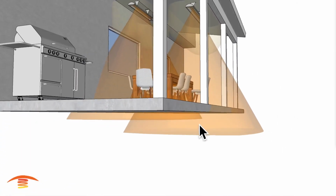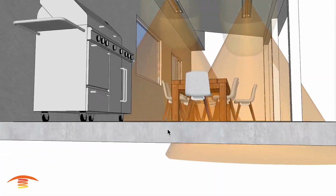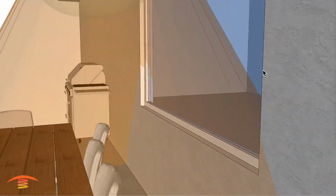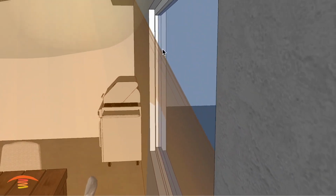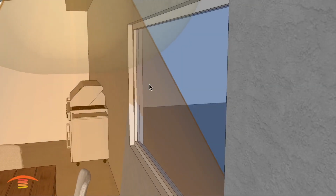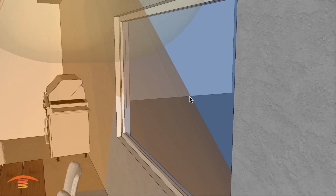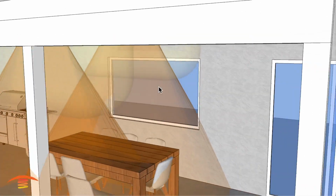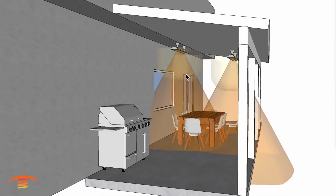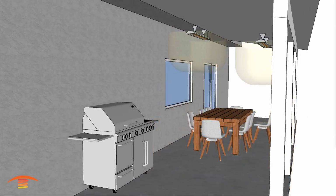You can see here, this is truly made for a higher installation height. Here, it's not so bad, but over here it is. Also, another note is the fact that we are penetrating that glass quite a bit, so there is a potential for expansion and contraction down here unevenly throughout this pane of glass, so that might also be an issue where that glass does break. So this is not my preferred application. I just want to show how this looks. So let's go ahead and turn that off.